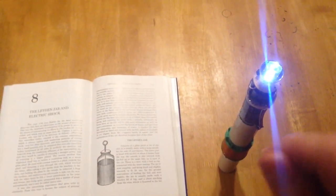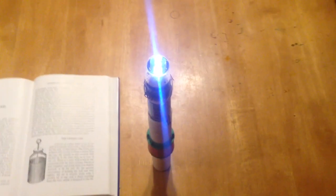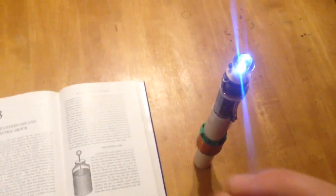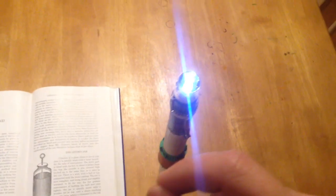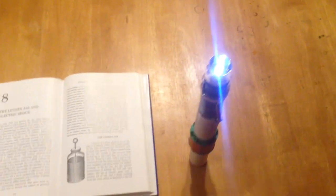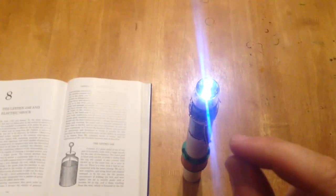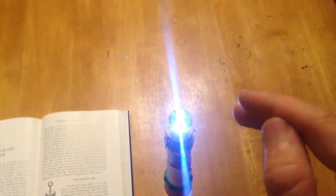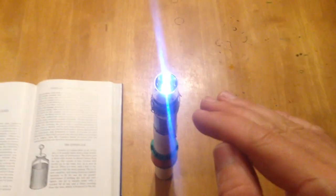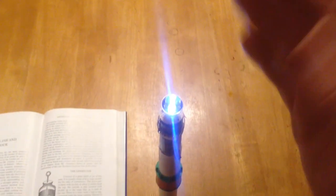On the new schematic there's a pot that you can tune. Whether you use that resistor or not isn't crucial — you can run it with no resistor, but for tuning you can use a resistor or a resistor-capacitor combination. Depending on how you tune it, you can get this thing running in a mode where it drops very negligibly in voltage. With a 50 volt, 10,000 microfarad capacitor, it may drop rapidly between 50 and 42 volts, then hold at 42 volts for an incredibly long time — barely dropping a millivolt at a time. Then it hits another range where it drops faster, and may hold again at 32 volts. Very interesting behavior.